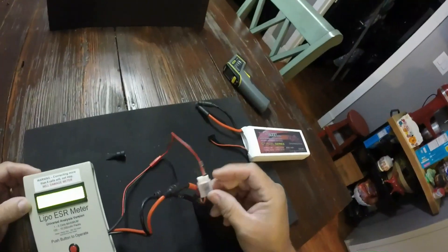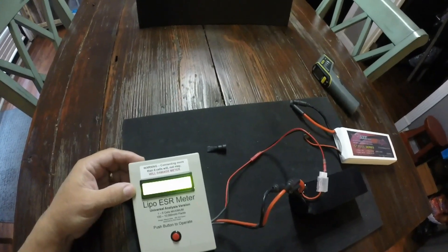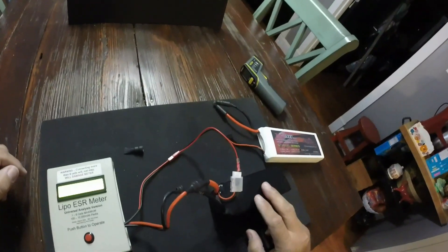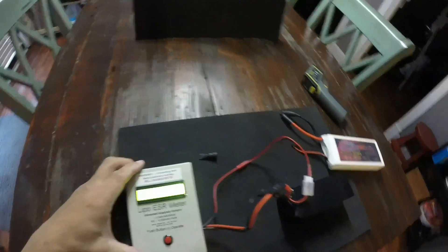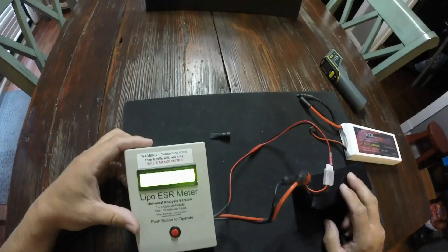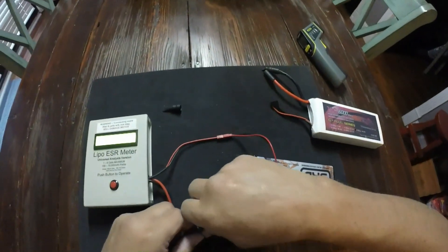That one is my strongest — 177 amps, 1.28 IR. Now some people are going to say they've seen better on their chargers when charging. I've also seen better than 1.28 — usually I'm in the decimals like 0.8, 0.9, 1.0 on this lipo. But this is just a ballpark tool. It helps you see how your batteries are doing. This lipo is a little stronger than the China Hobbies, and I've seen that in real-life testing also.